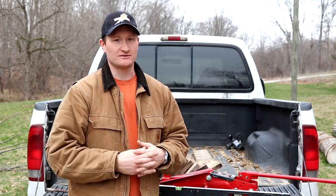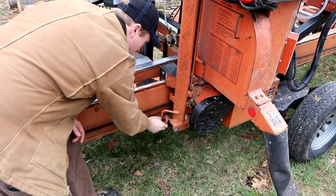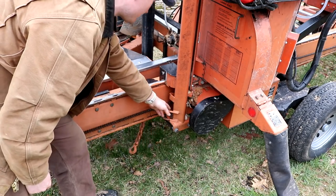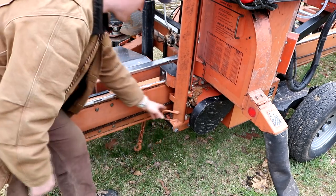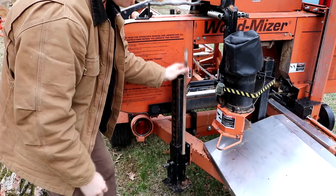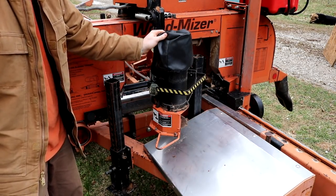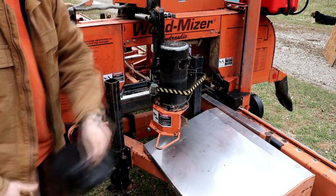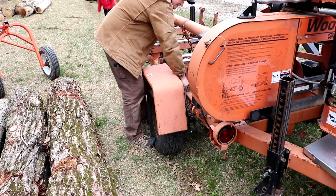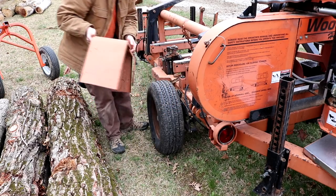Let's go ahead and set up the mill and see how long this actually takes. First, let down the dust chute. We've got to unhook this chain — it's an emergency chain so that if you're driving down the road and the head comes loose, it doesn't go back and forth and you don't lose it completely. That rod I showed you earlier is located on the back outrigger on the side. My machine is equipped with a debarker that runs on an electric motor; remove the cover on top so airflow can get into the motor. Also remove the fenders on both sides and set them aside.